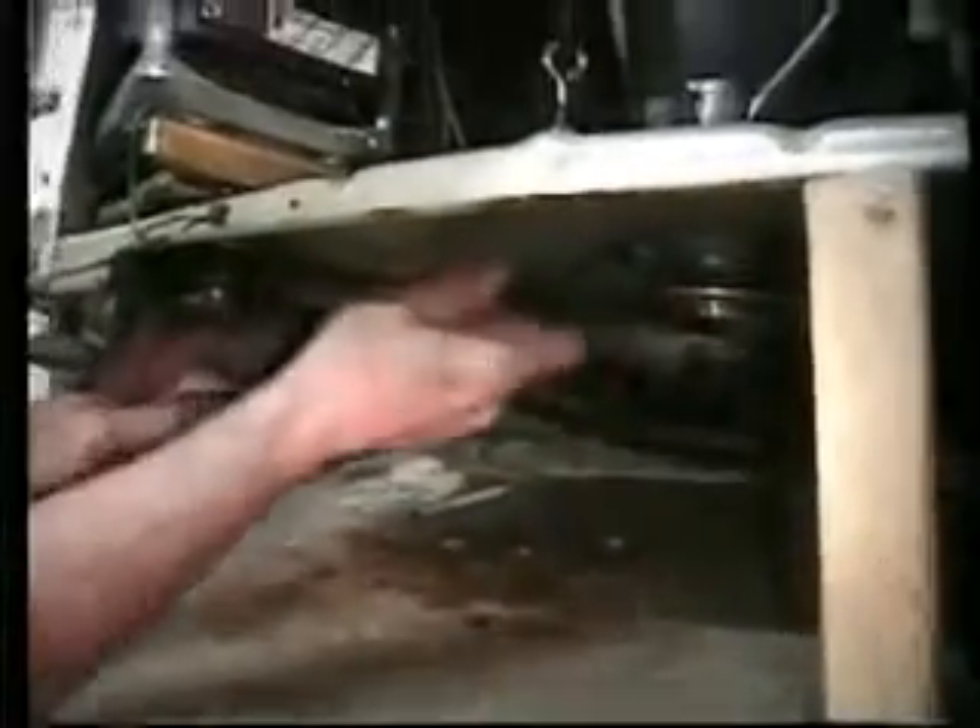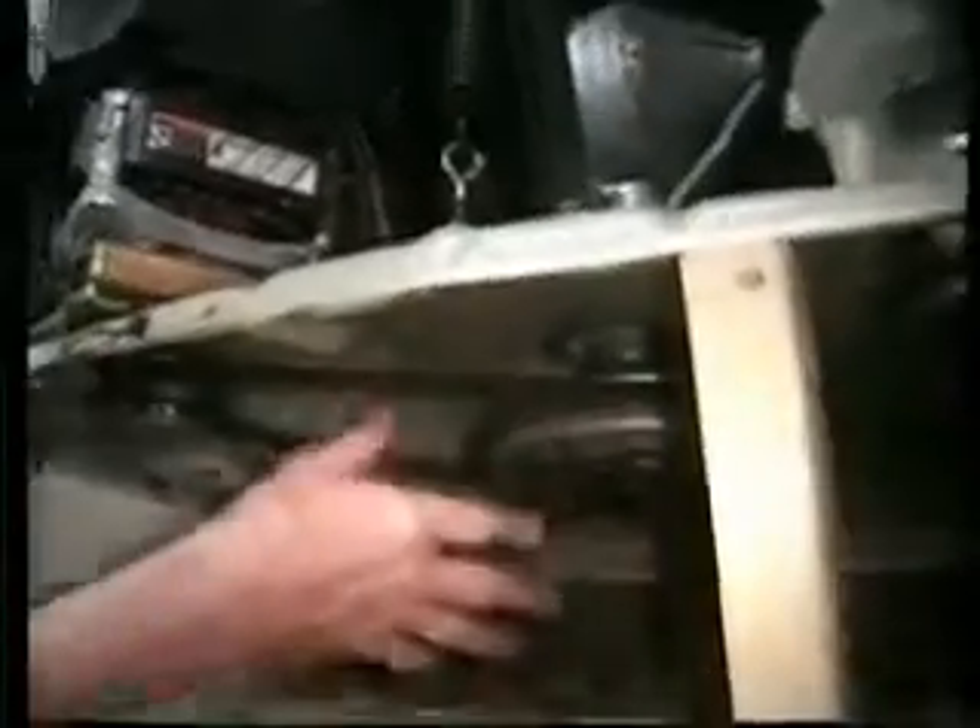To release the belt, you don't need any tools. The larger belt goes up on the pulley of the motor on the very top and you just work it around the transmission pulley right here. If you notice, these belts are very, very loose — that's the way they're supposed to be on Maytag. Never make these belts tight because you'll burn out the motor and cause other damage.